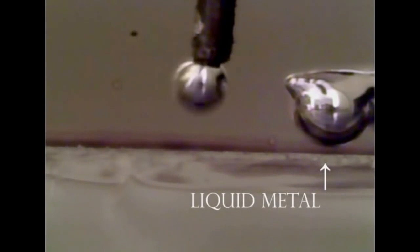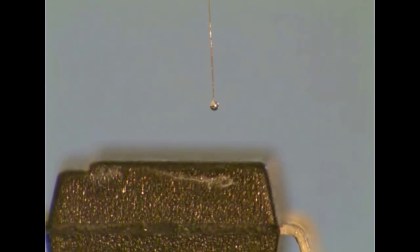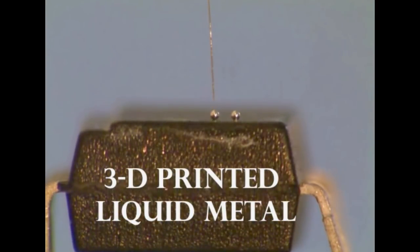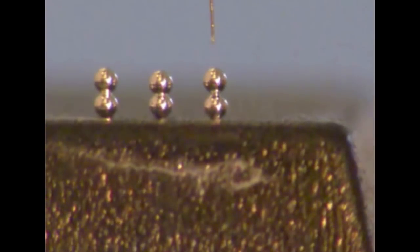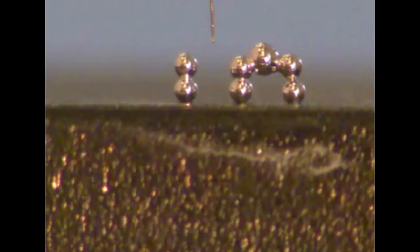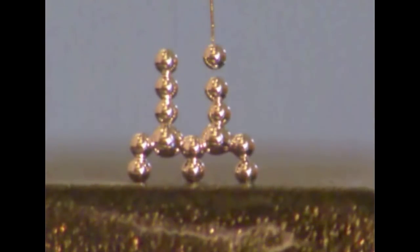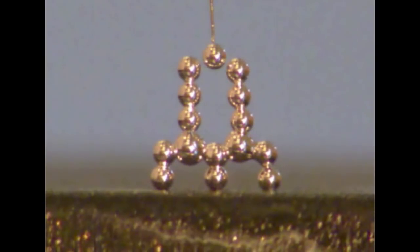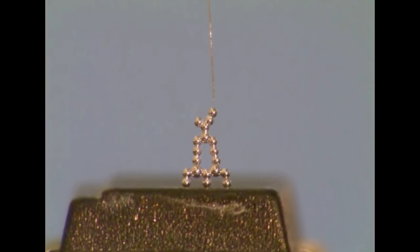One of the most interesting things you can do with this oxide is 3D print the metal. Here we have a syringe with a drop of metal. If we pull the metal back in, you'll see the skin kind of wrinkle up. But this oxide, which forms spontaneously and essentially instantaneously, is strong enough to allow these droplets to be stacked on each other — even though they're liquid just like water — and hold their shape. You can now 3D print metals at room temperature in a way that's compatible with a variety of materials that would otherwise not be possible.